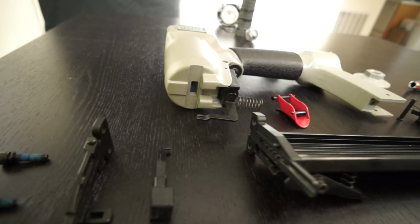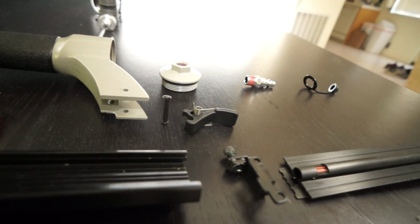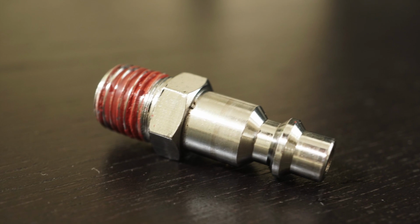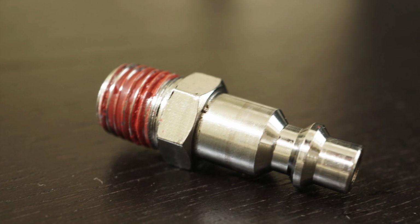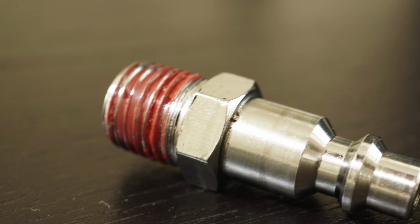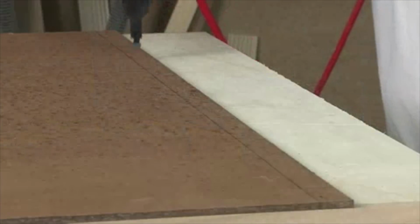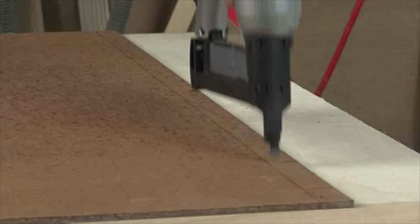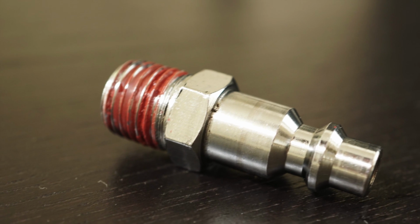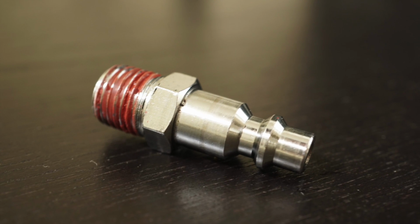As we disassembled the nail gun, one of the first things we noticed was that the tool was not designed with disassembly in mind. All threaded parts had thread locking compound applied and were considerably torqued. The main motivation in having done so was probably due to the nature of the tool's intended purpose. A nail gun's task applies large impulses on itself through the action of the internal hammer driving the nail into the workpiece. Therefore, we conclude that the application of the thread locking compound was to prevent the parts from coming loose and possibly causing injury.